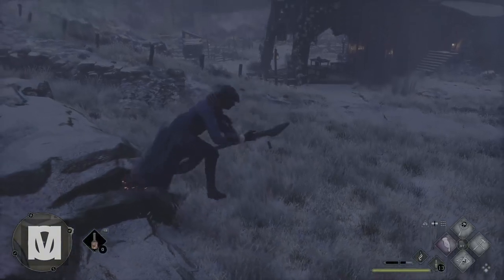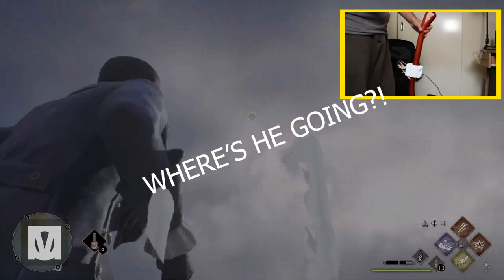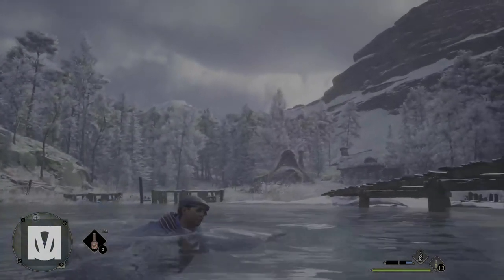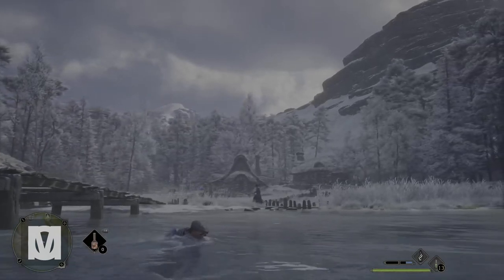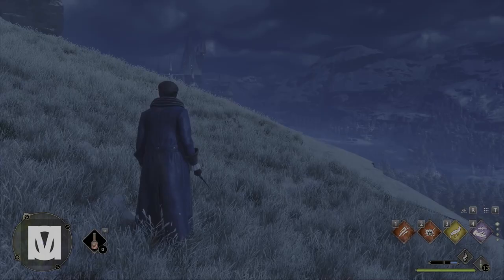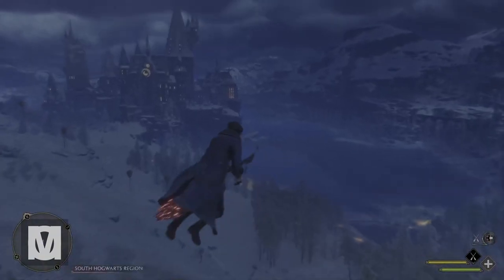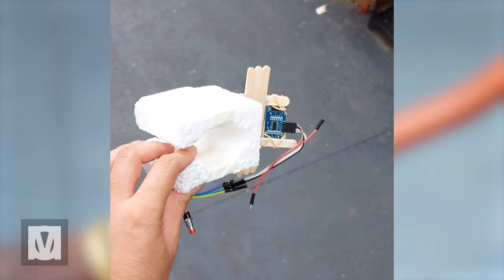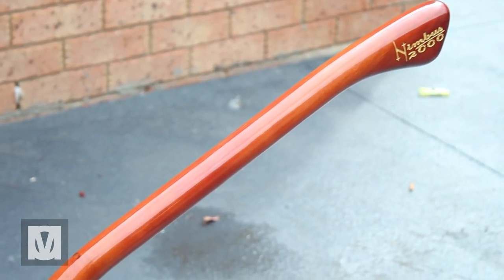This was a fun and interesting project — it made the game a lot more interactive, immersive, and tiring. Now there are three drawbacks. First: sometimes when I land and demount, the MC travels in a certain direction on his own — I think it may be due to flipping the broom too quickly or too slowly during dismount, causing the Arduino to continuously send a joystick direction command. To counteract this I ended up using the reset button on the Arduino, which resets the mount state back to zero. Second: I got quite a sore back from emulating the MC's body positioning to trigger the boost and normal flight speeds. Third: the sensor mount design needs improvement — by the end of filming it had lost quite a bit of foam and its ability to stay properly attached to the broom.